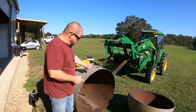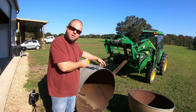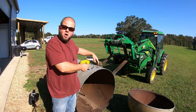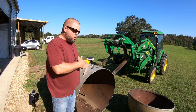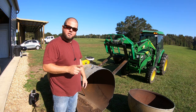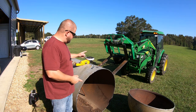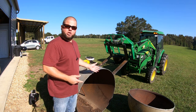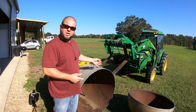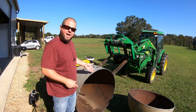But next time, I'll either weld me a bar across the top every so often to keep the dome from shifting while I cut, then I can come back and grind those tack welds off. And, you know, I think that should keep it from clamping down on the blade. However, one of the first cuts that I made, I was only cutting this far into it. There's no way the tank shifted. And this thing bound up so bad in the cut. Like I said, I had to try to disassemble it. The first one I had to disassemble actually wedged in there.